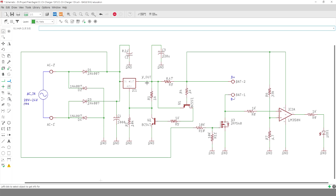On the other hand, when the charging current becomes lower, the transistors Q1 and Q2 will go to cutoff mode, and Vout will become constant at approximately 14.2 volts.